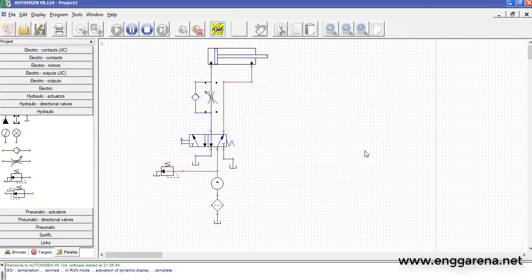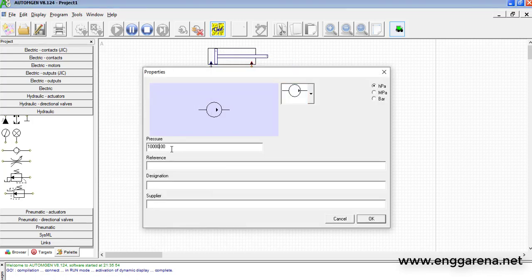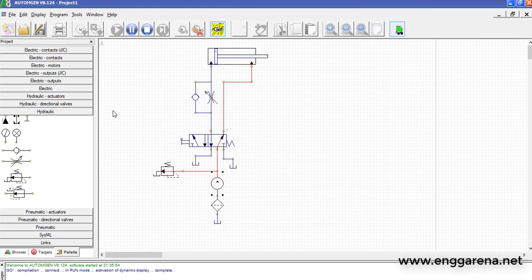We have connected the pressure line. Now let's give a forward stroke — let's set the throttle opening at 80% and set the pump pressure a little higher. You can see the forward stroke is slower compared to the reverse stroke. When the fluid goes from the piston side, the pressure relief valve releases the hydraulic oil to the reservoir. This is the basic circuit.